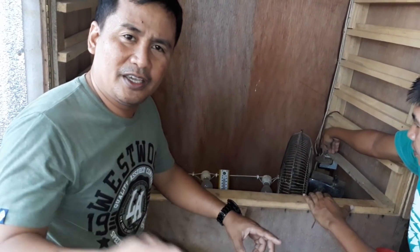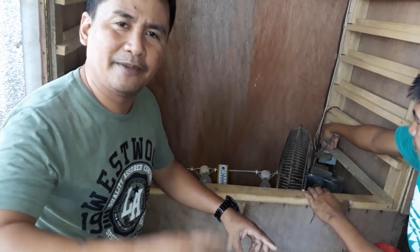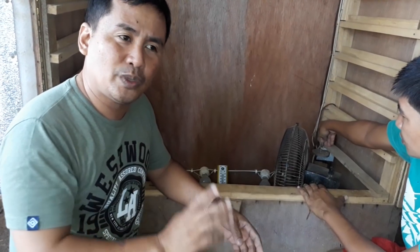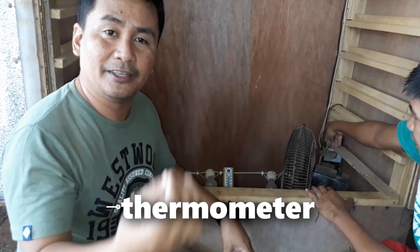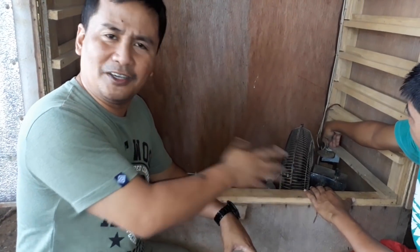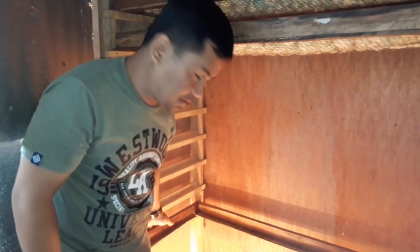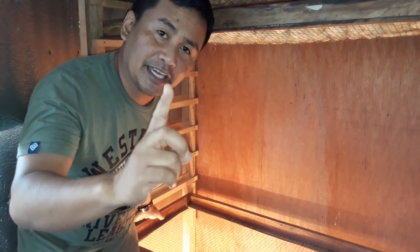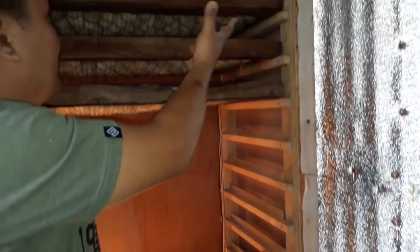This is very simple — if you don't know how to wire it, you can just hire an electrician. What is important is that you have a 25-watt incandescent lamp, a thermostat, a thermometer, and an electric fan. That is all you need and you can do it yourself to start this duck business. Also, be sure that at the back portion there is a space so that the air can go up — there is a space here so that the air can circulate.